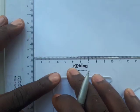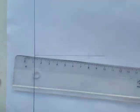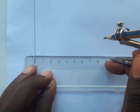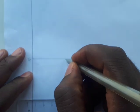After drawing the vertical line, drop a perpendicular to it at any convenient point of your choice. The next thing is to locate the focus. This horizontal line is the directrix, and we are told the focus is 40mm from the directrix. So measure 40mm from point G and locate the focus — that's the focus at F, 40mm from G.